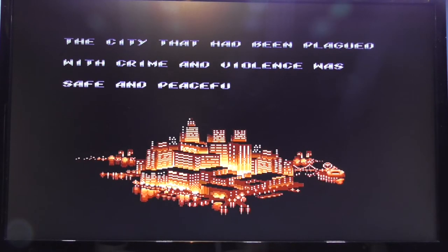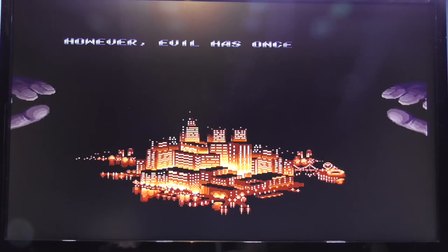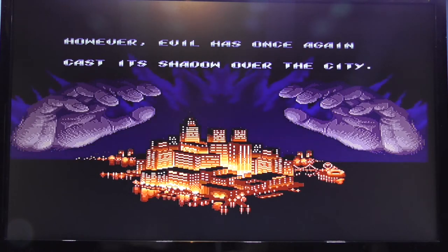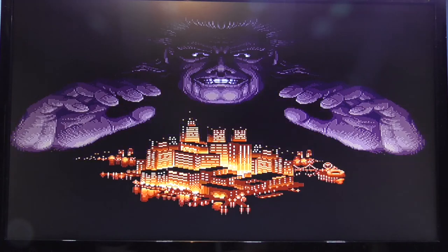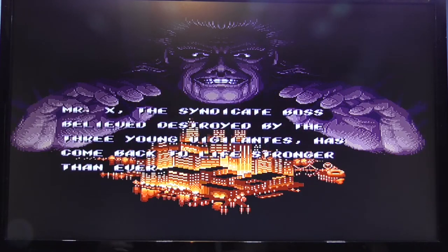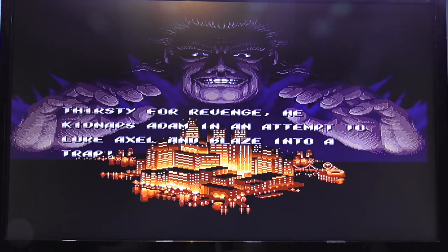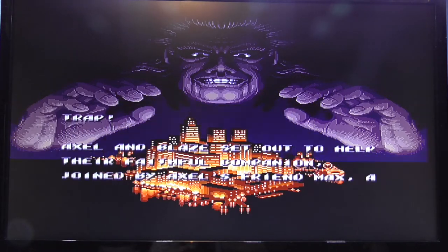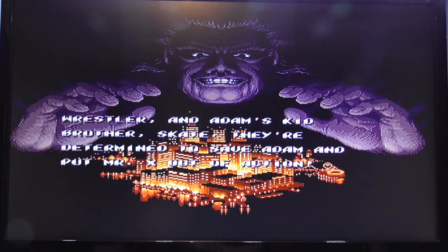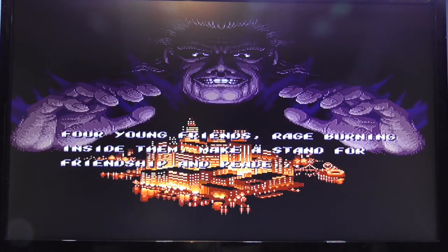Yeah, we're done, guys. This video is done. I just want to talk a little bit about what we've actually done. All we've really done is disable TTL C-Sync going to pin 7 on the output DIN of the Mega Drive and just send a more reasonable C-Sync that a TV would recognize. So we've not changed any of the pin out of the Mega Drive, so theoretically, my friend could, if he wanted to later on, sell this Mega Drive on, and the person who gets it can go out and get a composite video cable, hook up the Mega Drive that way, and it still works because composite video is still coming out on the same pin. He could go out and get an RGB Scart cable, and it would still work perfectly normal like any other Mega Drive.